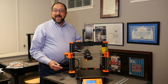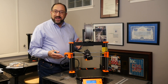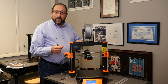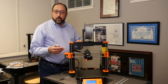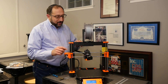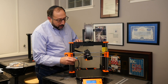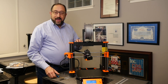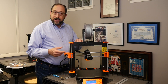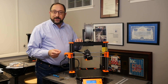Hi, this is Irv Shapiro, a.k.a. Dr. Vax, and we're going to talk about the original Prusa i3 MK3 and the problem with the filament sensor falsely detecting that the filament is out or jammed in the middle of a print. One of the contributing factors I found is that the idler screws are too tight, which increases the likelihood of getting false filament-out or filament-change detections.